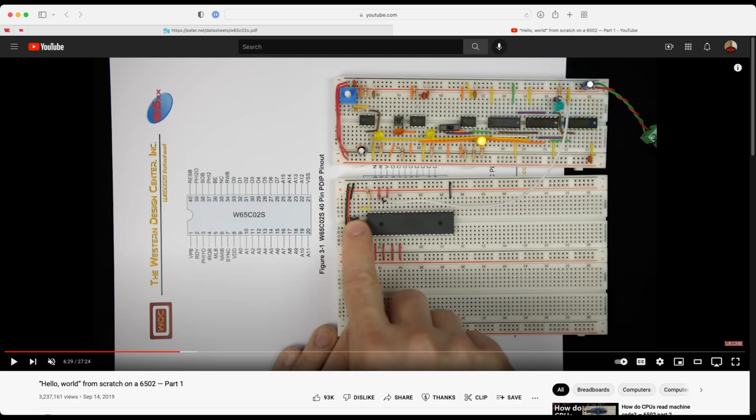The way you did it, you're following on the right side. It would be on top of this. Yeah, I think so. Then if you connect that over to pin 4, or sorry, not pin 4, pin 36. He also has pin 37 tied. Sorry, I said that wrong: pin 37 and 38. So what is pin 37? Pin 37 is Phi 2, and that is our clock pin. That's where the output from the clock gets plugged in.